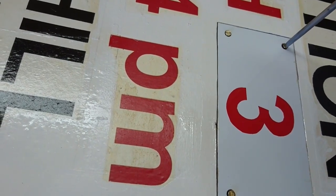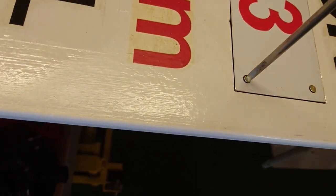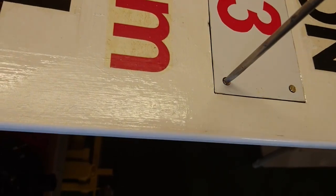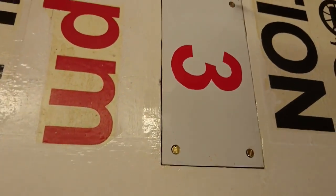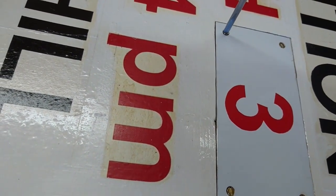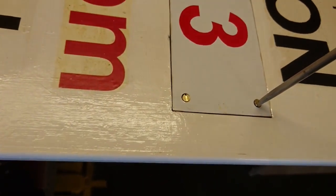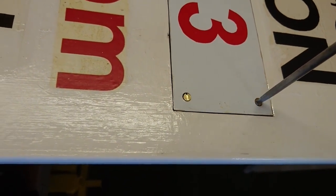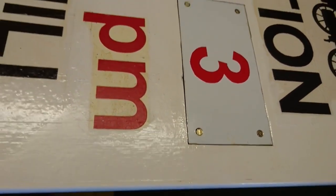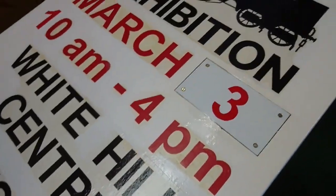Not tightening them all yet. Just go round one at a time, in a pattern, so it gives it some shuffle room. Don't do it tight, just nip it up, no more. Not power, just stops it falling off, and clamps it enough to keep the weather out behind. There we go. There it is.